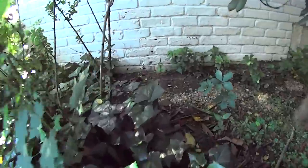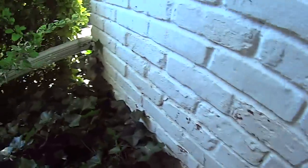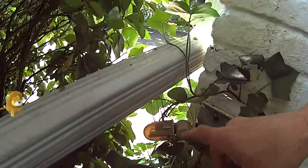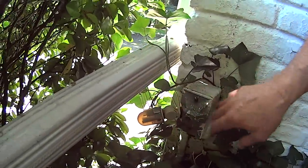You may have to look around for this stuff because it could have been here for decades. It's all covered with ivy and stuff. This is it right here. When these go bad, usually the lights stay on — but not always; the lights could be off too. So I've got a replacement photoelectric sensor. I'll show that to you.